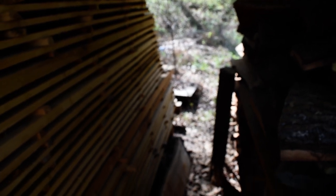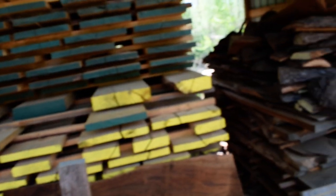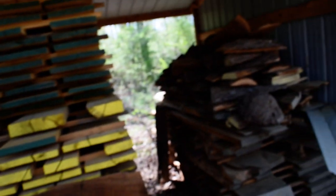This is a manual rack, by the way. If you've got a forklift you're going to do something very different — you'd make it so these racks are turned 90 degrees and you'd drive in and park your lumber with a forklift. Since I don't have a forklift this is all manual, and I'm limited to 12 feet wide. If I had a forklift I'd be making these spans much wider, like 18 feet, so I could get 16-foot boards in comfortably.